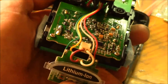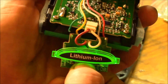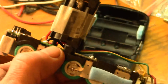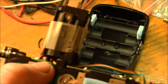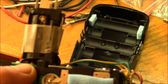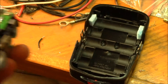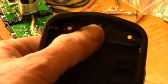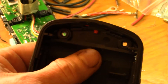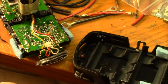I never actually pulled this one apart to look at it. Let's see if it lights up — I press the button and there we go, green. Like I said, the green wire is broken so there's no light. There's the little LED that should light up, and the green wire turns on the green LED. I'll get that wire fixed. It just sits in here with a little rubber cushion that holds it in place. I must have knocked it loose. There's a little push-button switch with that little red plunger.